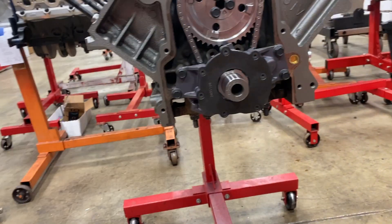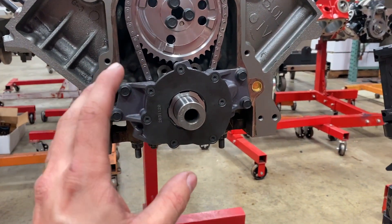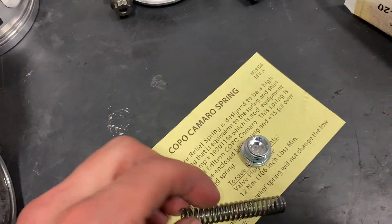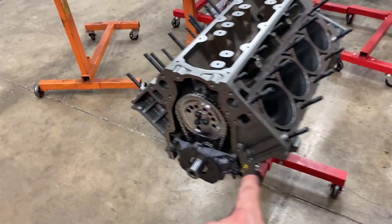That's pretty much it. This is by far the easiest way, in my opinion, to correctly shim the oil pump gears to the housing on an LS engine. If you do it that way and follow those steps, the gears should never fail. This is a Melling 10295 pump, which is a standard volume, but it comes with the Copo spring and the blue spring. For naturally aspirated engines I usually run the blue spring; for power adder builds I run the Copo. This is going to be about 1200–1400 horsepower twin turbo motor for my Corvette, which I'm going to the Texas Mile in, so I'm going to use the Copo spring and send it. Thanks for watching — I hope that video was helpful. Let me know in the comments if there's any other tips or tricks you want to see or any how-tos. See you later.